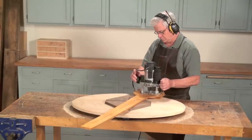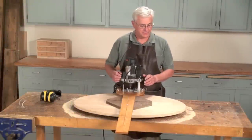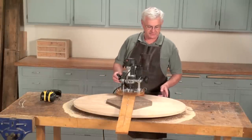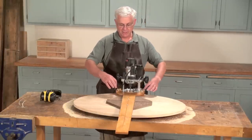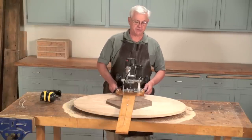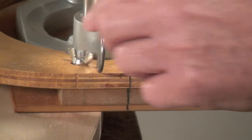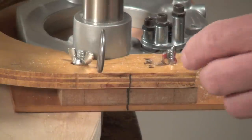That's the length of the router bit. We've now finished routing the three passes, and because it's got some very slight rough edges where the three passes came together, I'm going to show you the trim feature on this particular jig. We've got two pins here — these pins line up and keep the router in a particular location. One is going to be for your standard position, and by pulling the pins out, sliding the base forward, and reinstalling the pins in the trim holes, we will now be able to route off approximately a sixteenth of an inch.